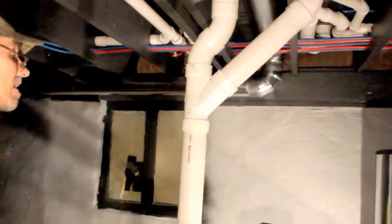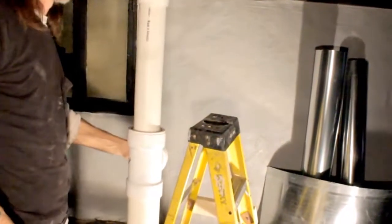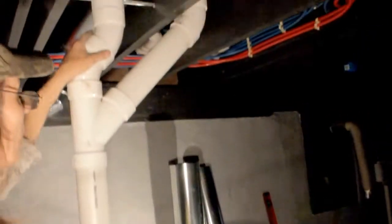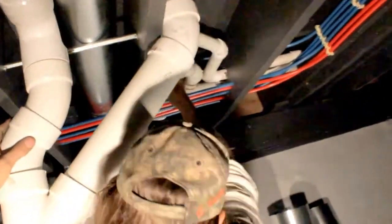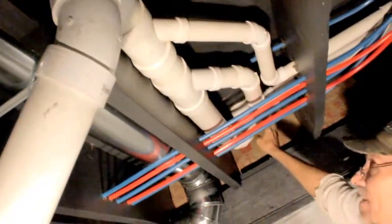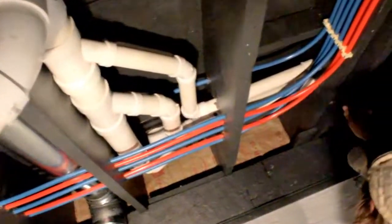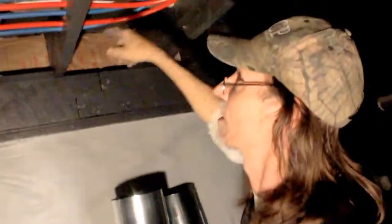Okay. All right. Main drain. Clean out tee. All right. 3" up. This one goes over, cuts across through here. Eventually it goes straight over and catches the toilet. This one goes over here and goes up. This is that 1.5" drain upstairs for your sink. So your sink is going to drain through here. Toilet's going to drain through there.